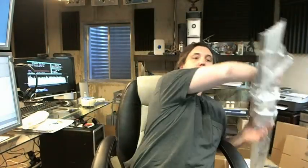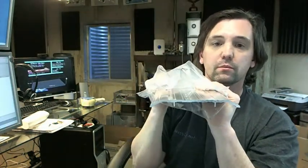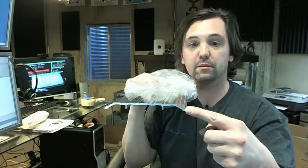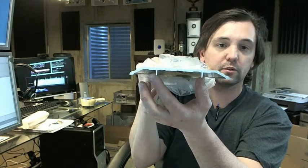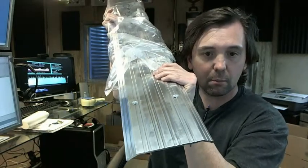Hello, my name is Rich Howard, owner of Architectural Builder Supply. This video is to bring you a closer look at the Dorbin 80A — not ADA, but the 80A threshold. The 80A is a very typical threshold. The '80' is representative of the fact that it's a saddle type, 6 inches wide and half inch tall, with a couple of webs below for support. The 'A' stands for the mill aluminum finish.